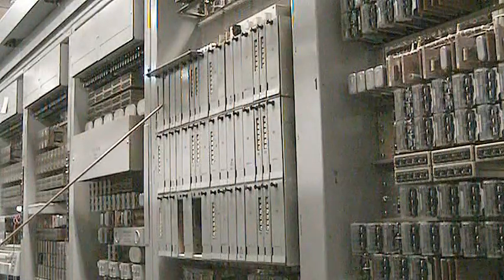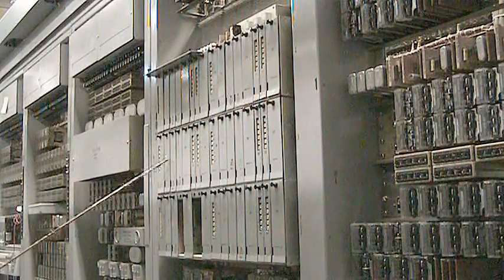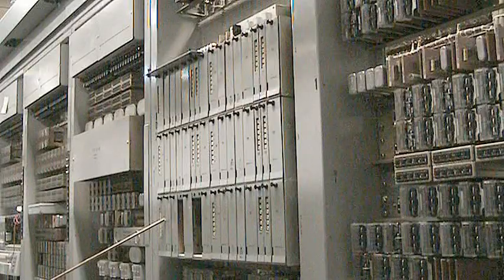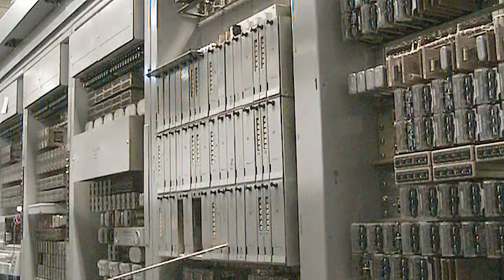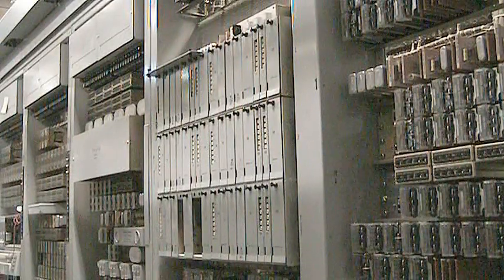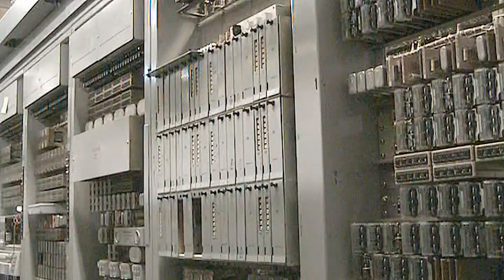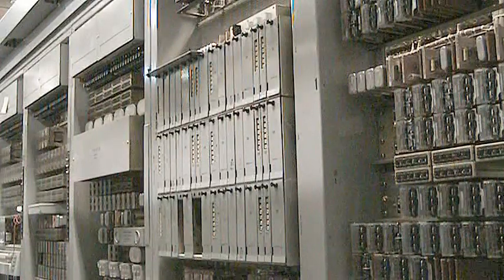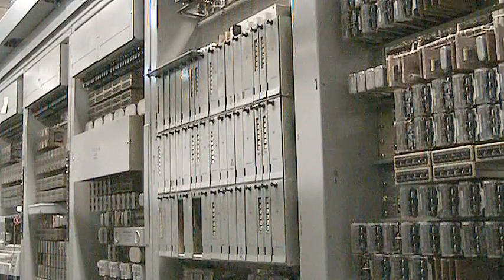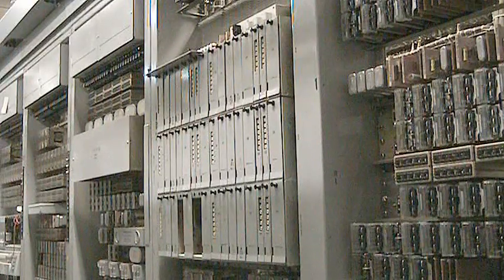These are the multi-frequency receivers that are wired to the incoming registers. I have 4 incoming registers in the office, and there are 6 multi-freq receivers here. One of these is not wired to anything. The other multi-frequency receiver is wired to the master test frame. So this office had 100% of the trunks capable of either MF or DP, which was unusual. In the number 5 crossbar, you would have trunk groups that were only MF or only dial pulse. But again, due to the size of the office, they made a lot of this stuff combination, so you could have either MF or DP.